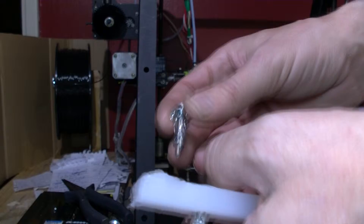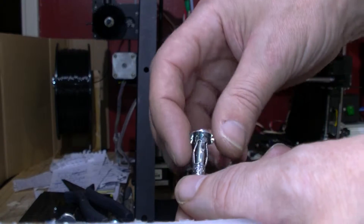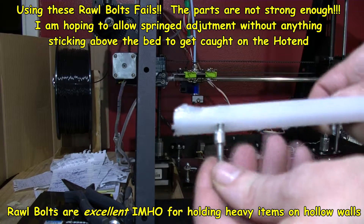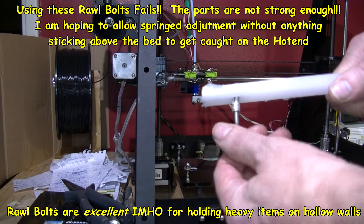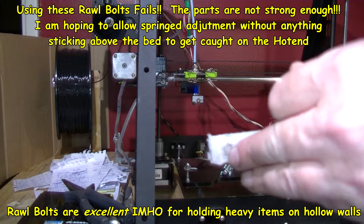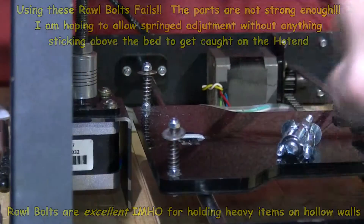I squeezed the edges of the plug flat using pliers - it doesn't take a lot of force. Then I drilled a 6.5mm hole in the plastic, because the eight millimeter diameter on the packet allows for the springs which normally have to be bent out, but I squeezed them flat. I pressed the plug in and then used the soldering iron to melt it in. That was just the first attempt. Basically one goes on each corner and that will give me quite a lot of screwing distance to adjust the bed. It's quite strong - stronger than just a hex nut melted in.